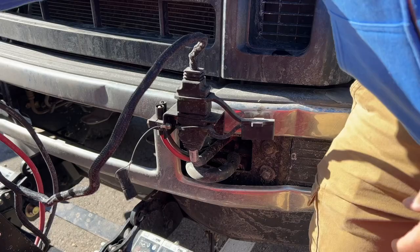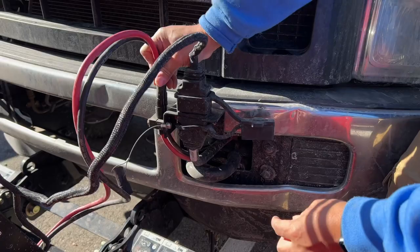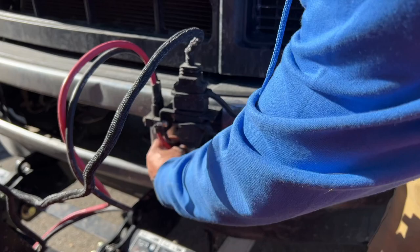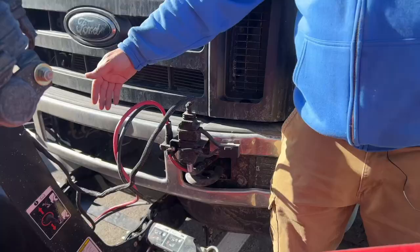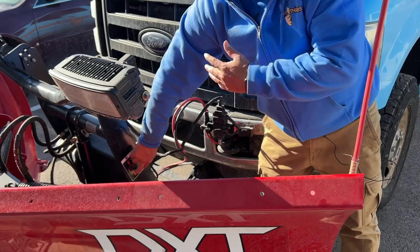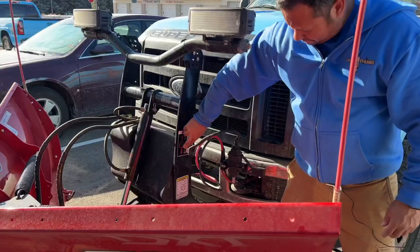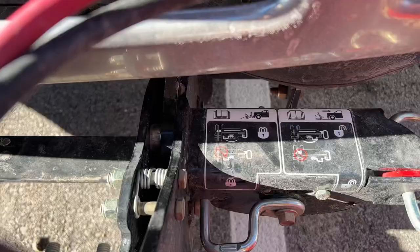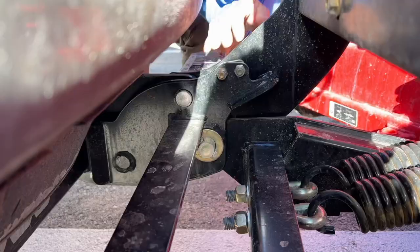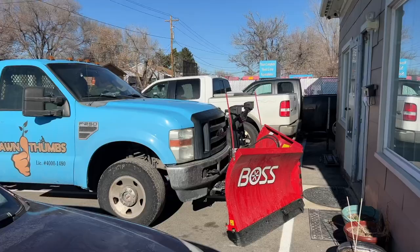Make sure to put these caps together like that — that will keep snow and ice from getting stuck in them while they're parked. We're missing one here, so I'm going to tuck this one away. Now that it's plugged in and we have the control in float mode, we press this button all the way up until we hear the two pins locking. The plow is connected — you heard the pins lock on both sides. I always double check to make sure it went through and that you can feel it on this side.